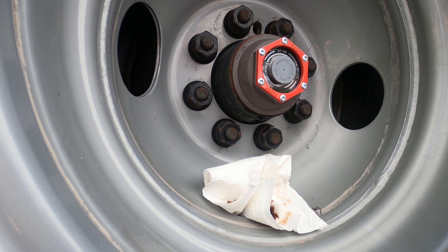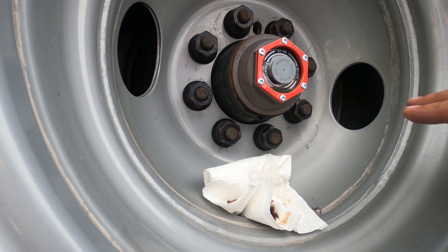One thing I found ironic is how far that cap had to come out before it started leaking — it almost had to come completely off. That's one reason I do like the oil bath instead of grease: if you start having a problem, you're going to see it — hopefully before a bearing explodes. And if you've ever seen that happen, you don't want any part of it. That's a day-ender, and money. If I'm having a leak or fault problem, I'd like to visibly see it first.